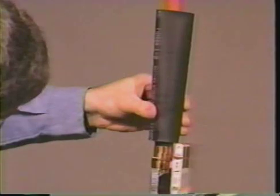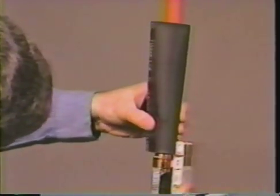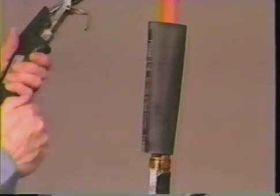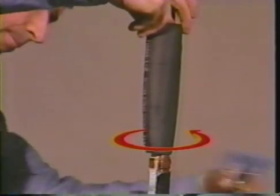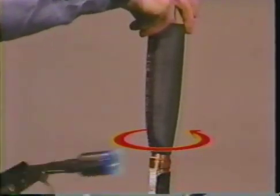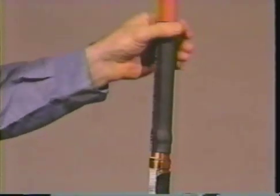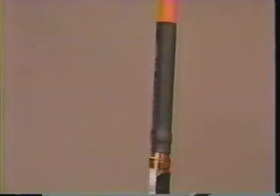Taper the SRM down to meet the insulation and tear or snap off any excess material. Position the black stress control tube one inch from the jacket cutback. Begin shrinking at the ground end and work the torch with a smooth brushing motion around the tube working toward the lug end. Make sure heat is applied uniformly around the entire tube. Inspect your installation visually — look for wrinkles and flat spots and reheat if necessary. Check for complete shrinkage by looking for uniform wall thickness around the end of the tube.